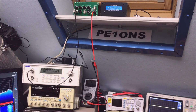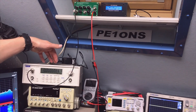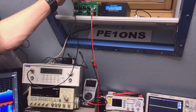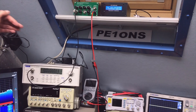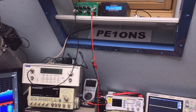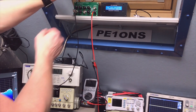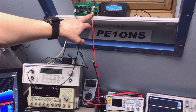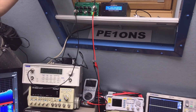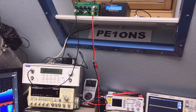Well, this is kind of spot on. But we are comparing this time base to this time base — it's not necessarily that this one is perfect, but at least you get an idea. Now I want to switch over to the GPSDO to see if that one is more accurate. Now you can see we have an extra LED switched on — that means we are now running on the external reference, so now it's just distributing the GPSDO signal. Let's see if it's any better — well, we're comparing super good to almost perfect, so I'm not sure if we can see a difference here.